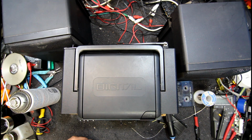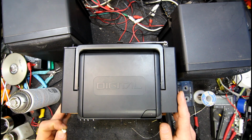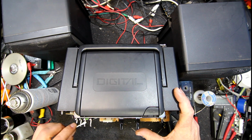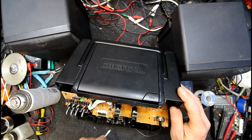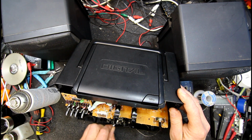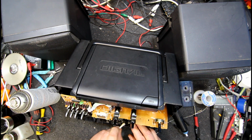And I'll give the tape deck a clean while I'm in here. And I guess I can go over all these buttons, give the switches and stuff a quick clean off too, while they're sticking out the front. One of those little mechanical erase head things with a magnet in it by the look of it. Not surprising, a tiny amount of stuff on the head. Capstan's got a bit on it. So it's had some use, this unit, even in the tape deck.